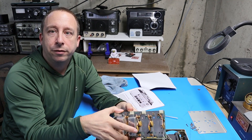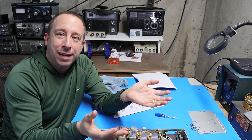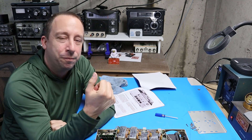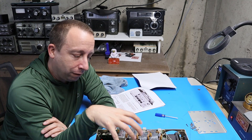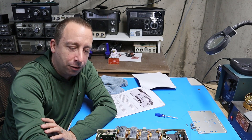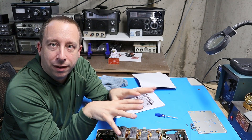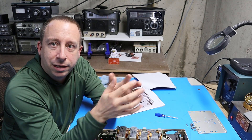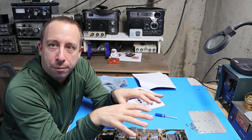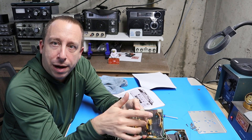There are a couple of ways around that. The first would be to swap the two filters — put the AM filter in the first slot and the sideband filter in the second. But then when I transmit on sideband, the radio would actually transmit both sidebands at the same time, which is definitely undesirable. There's a way around this on the website: I can do some cuts and jumps and repurpose a switch and indicator lamp to switch in the AM filter when I go to AM mode. Eventually I want to do that mod so I can transmit clean AM and join friends that operate old boat anchors on AM. But in this video I'm not going to do that mod — I'll save it for the future. What I am going to do is take one of the empty filter slots and do the bypass mod on it.